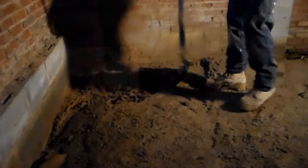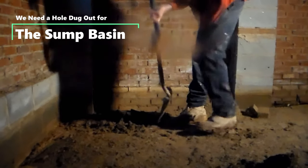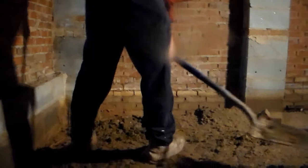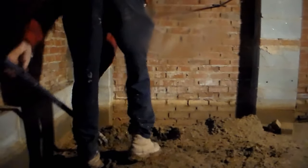Coming into this crawl space, you can see that it's really narrow and tight to get in. Once we come in, though, it's quite nice — we've got almost standing headroom down at the bottom where all the water is draining and where we'll put the sump pump. Along this wall, we will put a gravel perforated pipe to bring that water down to the sump pit. This is something the homeowner could do themselves — it just takes a little bit of work, labor, and materials: sump pump, sump pit.